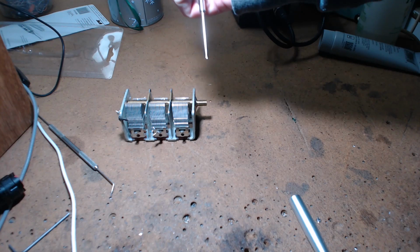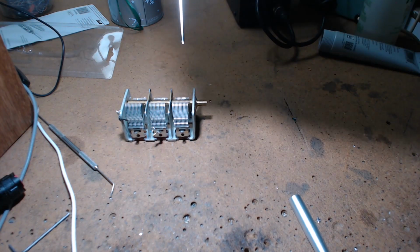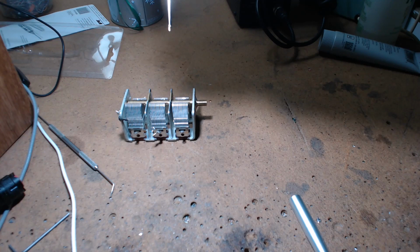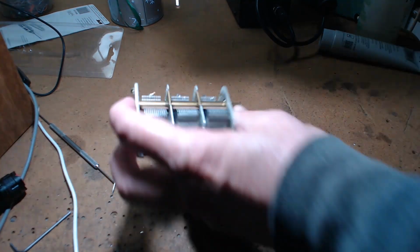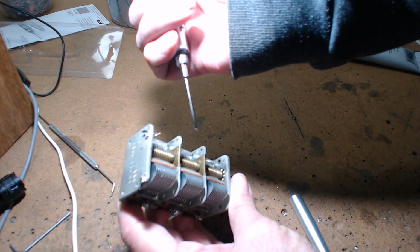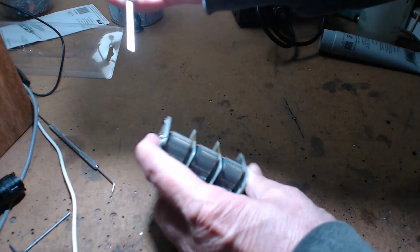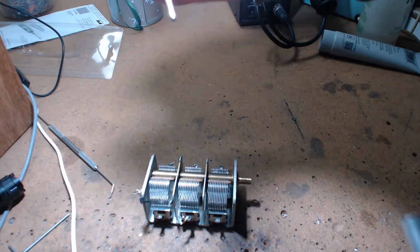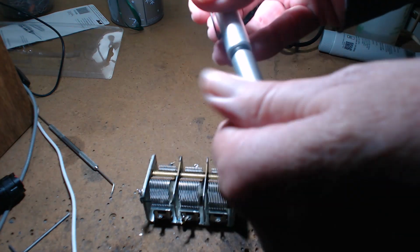As you push down on the plunger on the back, okay, this thing comes out, almost like a leaded pencil, a mechanical pencil. We press it down. See it there? Hopefully you see it. Now when it goes back in, it leaves a drop of oil. Okay? That's why they call it a precision oiler. And it's a smaller drop than the toothpick method. That's all I wanted to add in there.